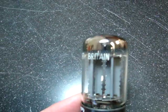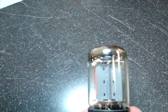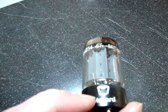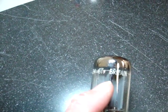A later version had copper line plates and seven notches in the plate. As you can see when you revolve it very carefully, you can see the copper along one edge. These tubes also sometimes had the new logo stamped on the base, frequently saying 5AR4 GZ34 Great Britain.